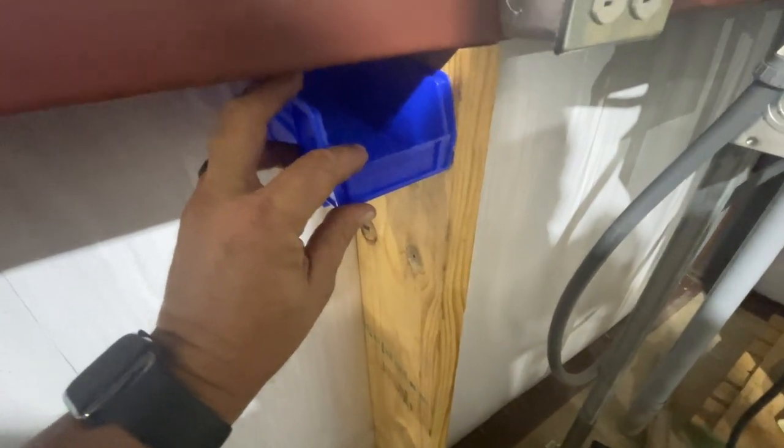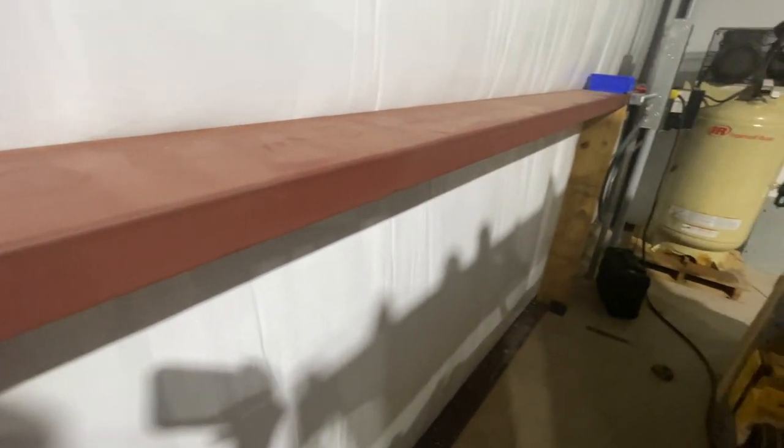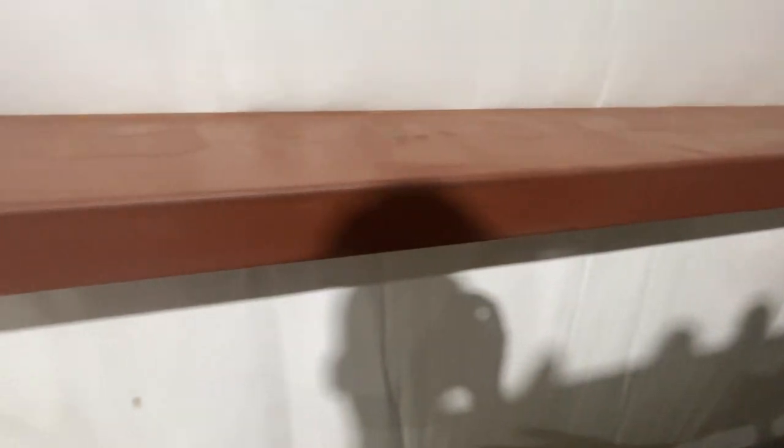These bins are about 3 inches, so we'll give it a little extra. That'll go 5 wide at 2 feet, so that's going to be 10 feet. The bottom will have enough space — we'll leave enough room for putting stuff like buckets, because you always accumulate hardware. With the rest of it I'll just make shelving at various different sizes. In the end, I'll be able to use the top purlin as well, because with all the uprights in place it will be sufficiently supported.